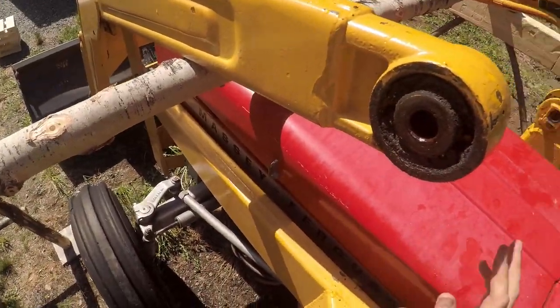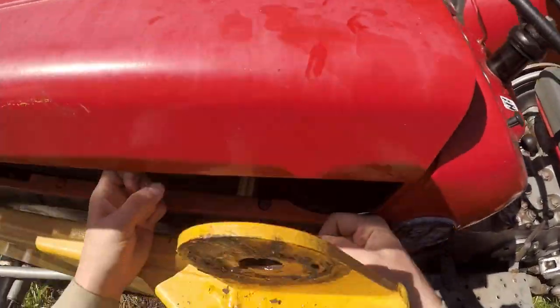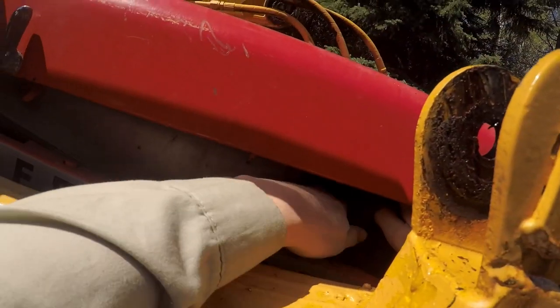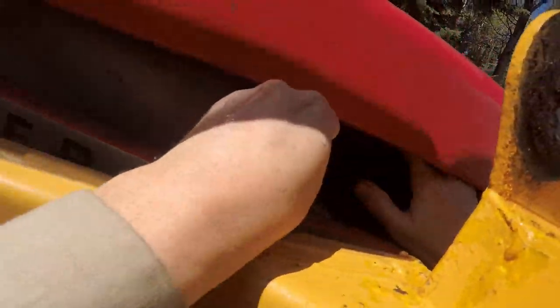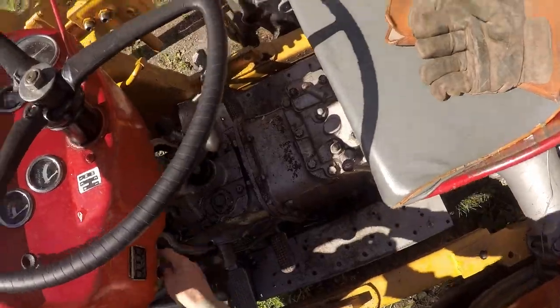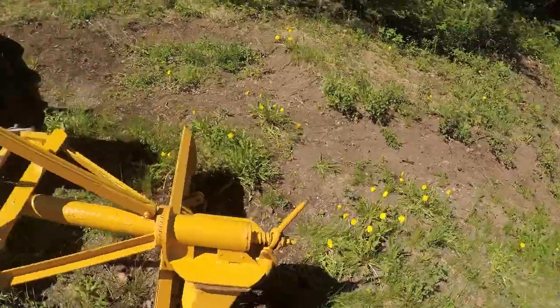Now I can't get to the battery. Oh, maybe I can just barely do it. I gotta keep the battery disconnected because there's a power leak. What do you call it? Battery drain, because the field is always hot on the alternator. Need the key. Be right back.